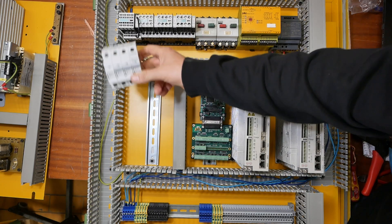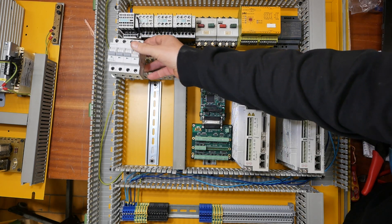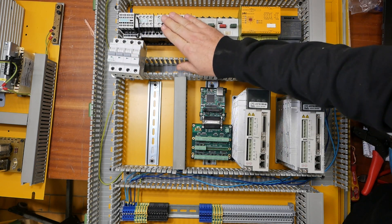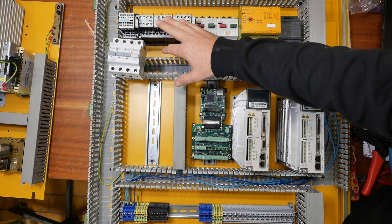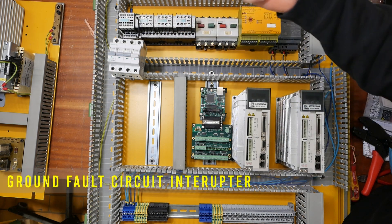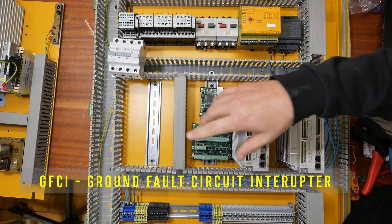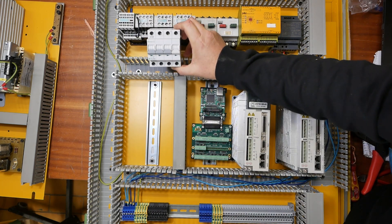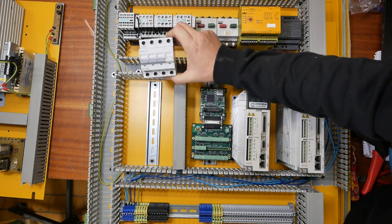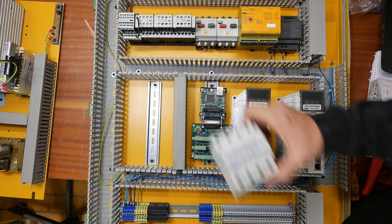You may have noticed when I put this together I was given this three-phase breaker, which I really appreciate. But an electrician friend of mine pointed out that because this lathe is on a household power supply I've already got a ground — PE in German — and also a 16 amp circuit breaker protecting the circuit in the house. It's not actually per code to put a breaker behind a breaker, so this I'm not allowed to install. Thanks a lot for giving it to me but I'm not allowed to use it.